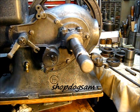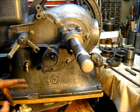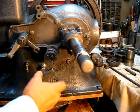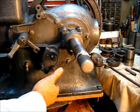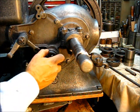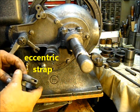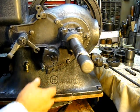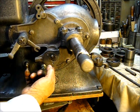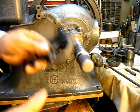I had actually not — was going to go this way, but let's go this way. I have not decided which fuel pump to use on this engine just yet. There's two options with this kind of side cover. This is the eccentric, the cam. The other one that has the lever that would go on the back here would have a roller in it. I'm not going to use that lever, so I am going to use one of this type up here.